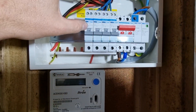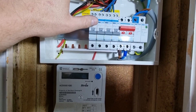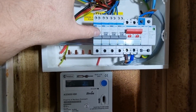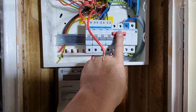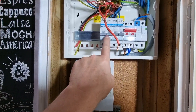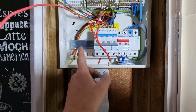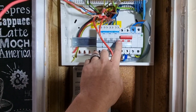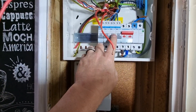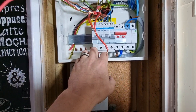For anybody that doesn't already know the difference between an RCBO and an RCD: an RCBO is simply an RCD combined with an MCB — a miniature circuit breaker — all in one unit. Instead of what we used to do, which was have a main switch, then an RCD, then all your circuits, then another RCD and more circuits — what we called a split load board — we've now moved over to full RCBO boards. You get a lot less nuisance tripping, and there's also a regulation that states one circuit having a fault should not affect another circuit. Having these individually RCD-protected means a problem with one circuit only affects that one circuit. They're far, far better.